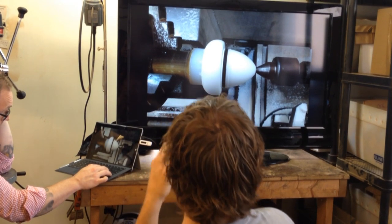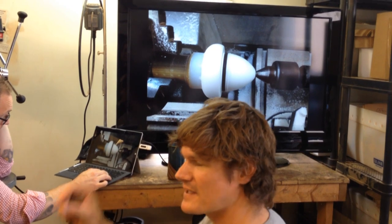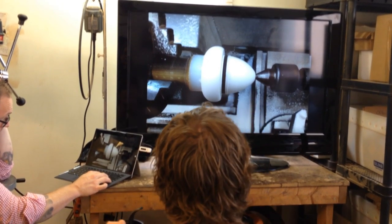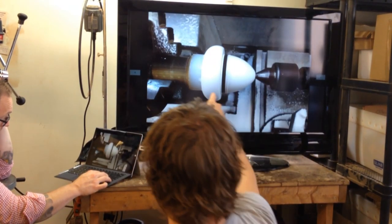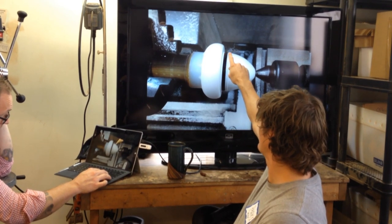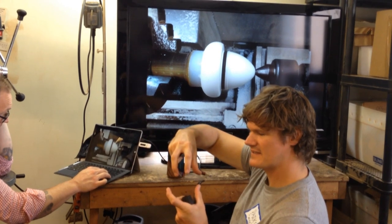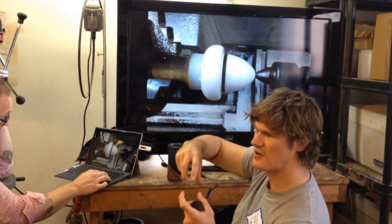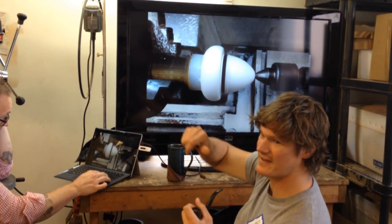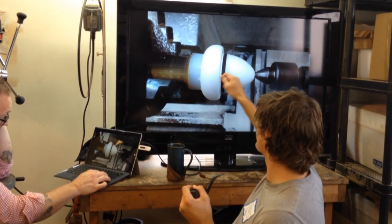Did you have to do the space for the O-ring in there? Yes, create a space for the O-ring. The issue there is: am I leaving enough wall thickness at the thinnest point where the O-ring is? And the O-ring fit is actually kind of tricky, because it can only be a hair above what this fit is. I fit it so I can feel the fit, but it's not tight.